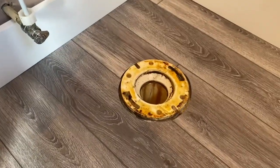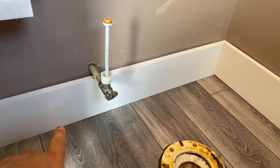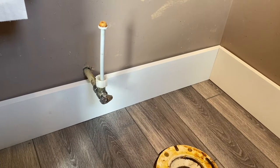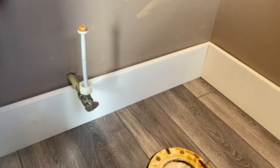This is where we're installing the toilet — we redid the floor. A quick tip: if you are going to redo your baseboard, put that on before you put the toilet in, because you'll never get back there without making a couple different cuts and having some seams. So it's not nailed, I just set it into place so I can come back later and give it a nail.